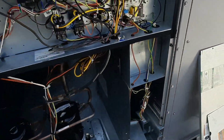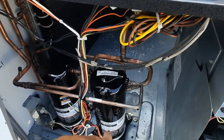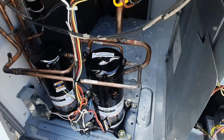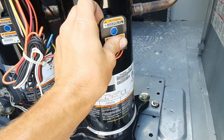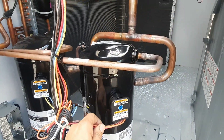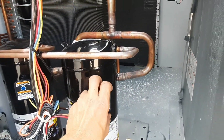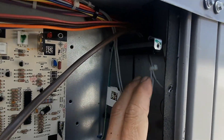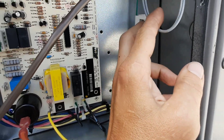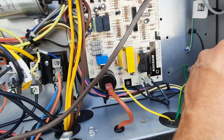Let's turn it off and take a look at the wire diagram to see where all this ties in. We'll ohm out the compressor and see why - did it fall off, was it pulled off? I'm not sure which one is stage one - they're tandem compressors. Let's start figuring that out. This looks like the gray wire that goes over to the freeze stat and the return.